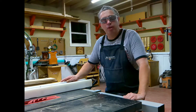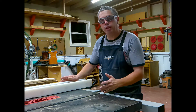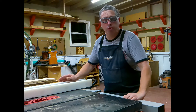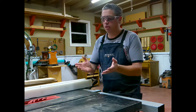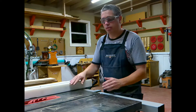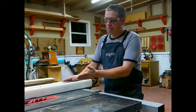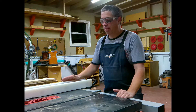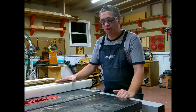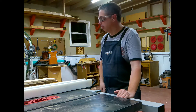I've got all my work pieces milled down to the final thickness, and now I'm at the table saw and I need to rip cut these down to the final width. Since I'm making two different trays — one's going to be beveled with sides that flare out — I need to include a bevel on those side pieces. I've got my blade set at a 14 degree bevel, and I'm going to rip cut the pieces for the bevel tray, then readjust the blade and cut pieces for the straight tray.